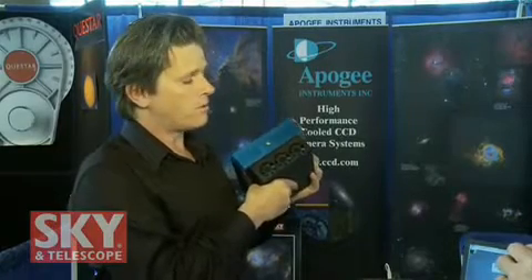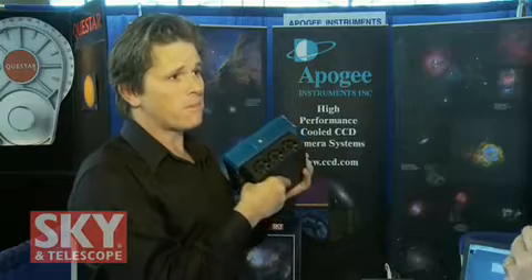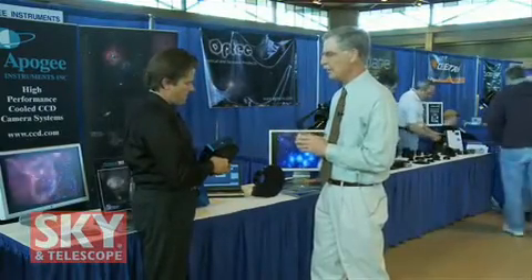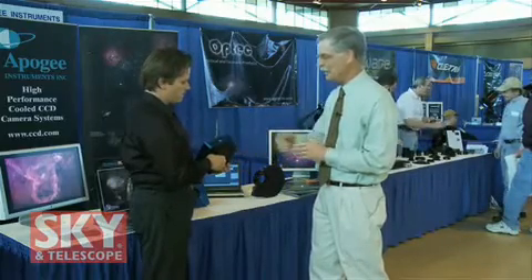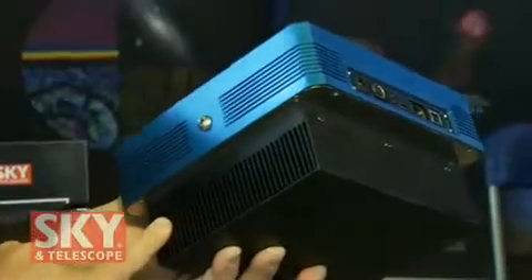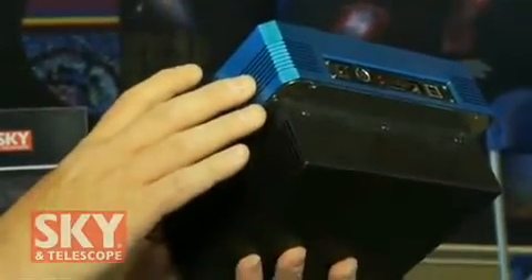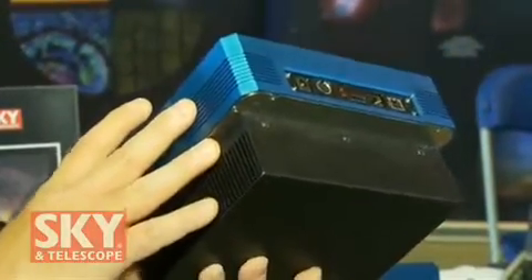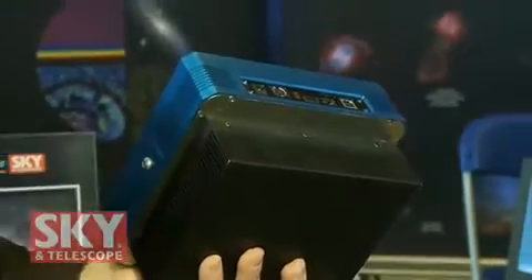That's a big advantage to have the cooling. Well, that and the read noise — people are going to be stacking multiple images, so the read noise on these cameras is typically 6 to 10 electrons. The read noise is probably going to remain the same on these platforms, but the thermal noise is important. Additional cooling will help customers in hotter climates — if they're in the desert, they may need much more cooling. The Peltier coolers are thermoelectric cooling devices used to drop the temperature of the CCD, and the heat is blown off the back with fans. We've added a fan shroud on this unit, and the large heat sink is on this side. Adding the larger heat sink, the larger Peltiers, and the fan shroud system is how we're able to get much deeper cooling. It adds a couple of pounds to the camera, but if you live in a hot climate it makes a big difference.